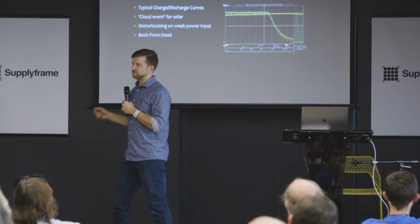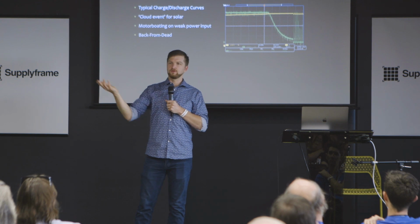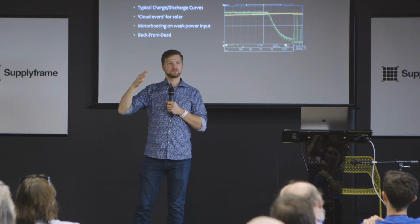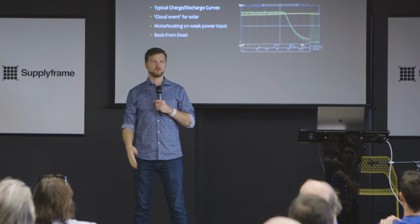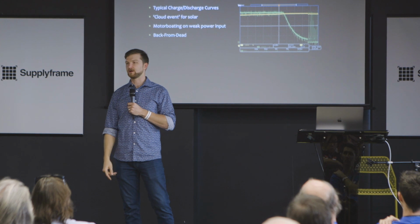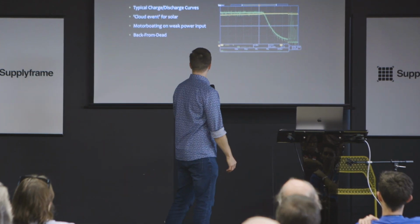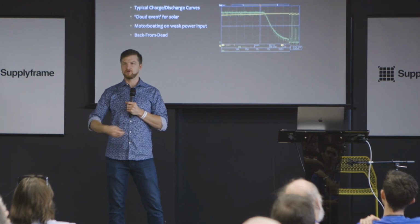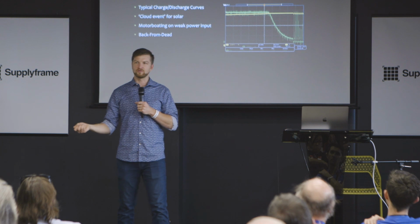The other thing that you've got to be very mindful of is a cloud event. So in solar, clouds come. How does your system deal with that? It's all happy running in steady state, and then a cloud comes and the entire front end of your power system has the feet knocked out from under it. What are you going to do about that? You want to make sure that you can handle that. You can use just newspaper or whatever to simulate that. It's really easy to do. It's not a big deal.